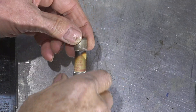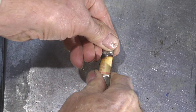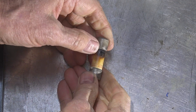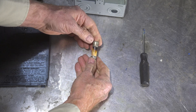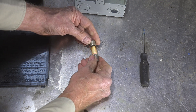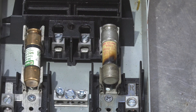Looking closer at this fuse, you can see this end is loose. A lot of times when you come to these things this whole part will be completely burned away, and there will be diatomaceous earth laying all over inside the disconnect. Do not consider when something like that happens to a fuse that it's the fault of the fuse - it is not. There's no short, no overdraw - the disconnect is defective.